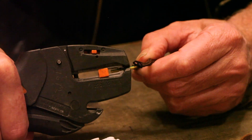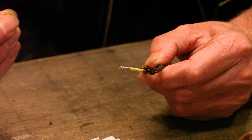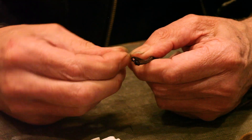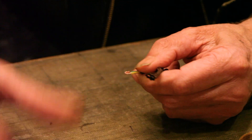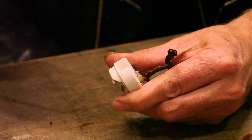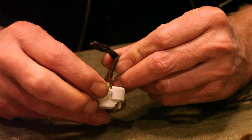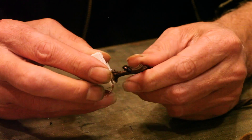We've stripped the cable - it's double insulated. What we do is just twist that up, then turn it over so we get a little bit more thickness of cable, then insert it, let go of the braid, and tighten that up. To explain: this center back terminal connects to the earth tab which makes connection to the body of the lamp holder to maintain a ground or earth.